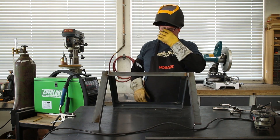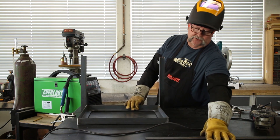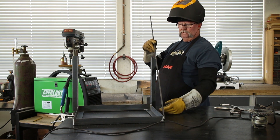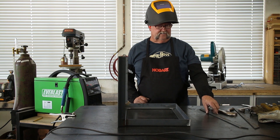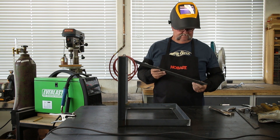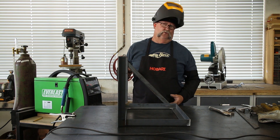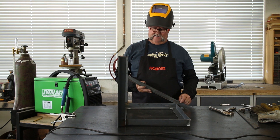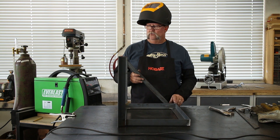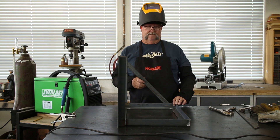That takes care of that. One thing left to do — get these brackets on here. Let me figure out how I'm going to do that. I'm just going to figure out exactly where I'm going to put these brackets. I've kind of overanalyzed everything, but anyways I got a couple of these brackets cut out. It's going to go right up here at the top and right at the bottom. At first I was a little concerned because they're going to want to drill a couple of holes at the top, and I was worried the bracket might be in the way. But the more I brought it down, the less support I was getting. So, to hell with it — I'm going up here where it should be, going down here. That's going to provide the best support, and I'm sure they've got plenty of room to drill around this thing. Let's get it clamped on and welded in.